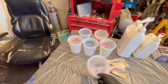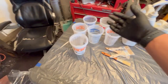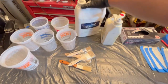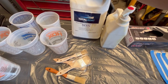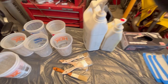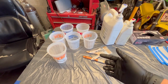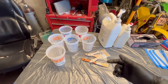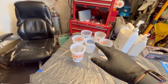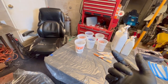Got two pieces per side and two pieces for each of the little hole sections. Got a bunch of mixing cups — in my experience you get like one shot per mixing cup when using them in the same day, though you can peel them out or throw acetone in them. We've got a Total Boat system, two-to-one clear non-blushing. Going to mix this up with a mixer attachment I bent for the front of my drill rather than using a stick. We'll throw the camera up on a tripod on the toolbox and get to laying some glass.